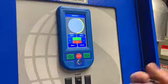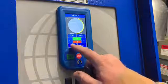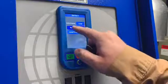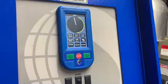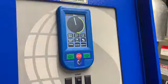If you have all the degrees in there for turning on and turning off the second end gun, you would then hit Save. Make sure that you have your active program on Local, hit Run, Exit, Exit, and you'll see your second end gun is now loaded on your front page showing when it will turn on and turn off. It is highlighted in yellow, which is different from your primary end gun, which will be highlighted in red.